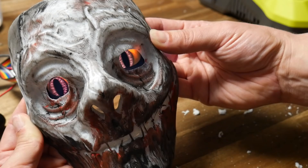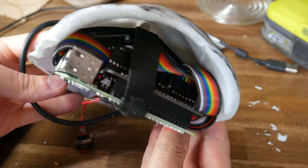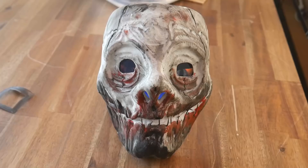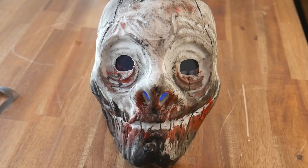Final fitment was not perfect, but it was much much better — well within tolerance. The model I chose was actually asymmetrical with the eyes, so it always looks a little bit off, but I still think it's a success overall. The TPU eye mount was held in place with four small dabs of hot glue, and then a velcro strap was secured to it to hold all of the wiring neatly out of the way. There is a cavity left over for the battery, but unfortunately my power bank is just a little bit too big. With a smaller one, the installation would actually be quite tidy. And here is the final product — it's not perfect, but overall I think it's pretty neat. The design of the mask, the paint, and those unnerving eyes all add together to make this thing pretty creepy.